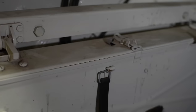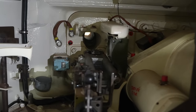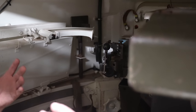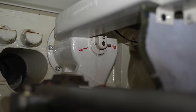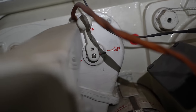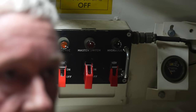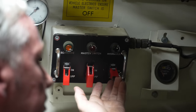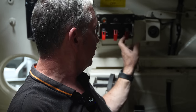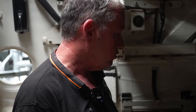On this side we have our 1,000-round belt for 7.62mm, which feeds into the MG3 machine gun co-axially mounted. When we're firing the gun we have a scavenger system to take out all the fumes from inside the turret. When firing the machine gun we simply change the handle around on the right-hand side of the machine gun mount and scavenge those fumes out. The loader's control box master switch provides power to the turret, and you also make sure his hydraulics are on. He can switch the hydraulic switches off if he needs to do something within the traverse area, so the gunner doesn't accidentally traverse on him.